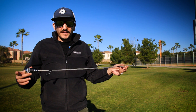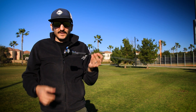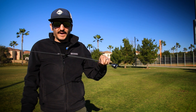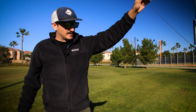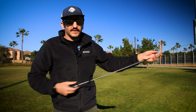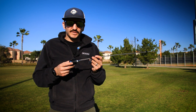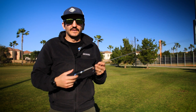Of course, this mast and radio does nothing without the proper antenna. You're going to have to pack this separately — if you want to velcro it to the mast you can, but it's going to add considerable length. I have this cut down to VHF and it's a good four feet or so. The radials themselves are 22 inches and those go on the NMO mount, all four of them, to create the ground plane.